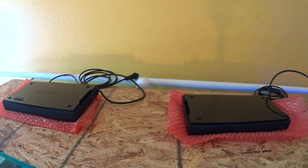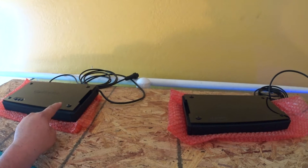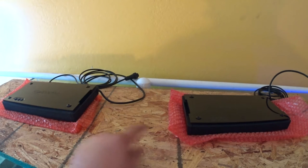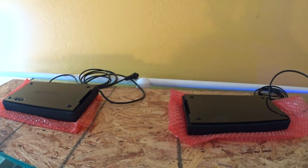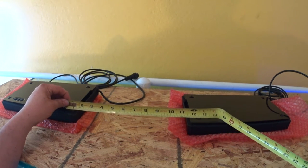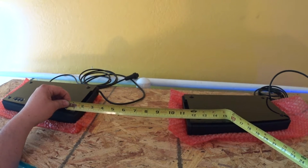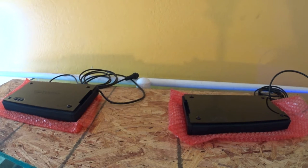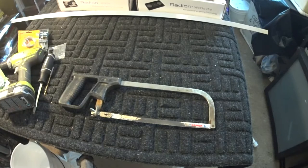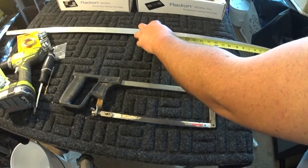Here we're gonna start taking some measurements of the light fixtures. I kind of took the idea from Bulk Reef Supply — they have a video on this — but I'm using the first two bolt holes so my buttons aren't covered up. The Gen 3 buttons are really nice, the Gen 2 buttons really suck. I'm going to measure a half an inch past the actual holes so I have a little bit of edge at the end and my holes aren't right at the edge of my cut. So I'm going with twelve and a half inches and making that cut on my first piece of angle iron — I'll just call it angle iron even though it's aluminum.